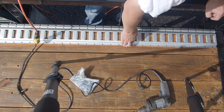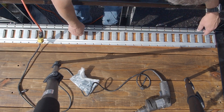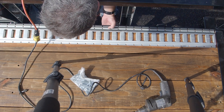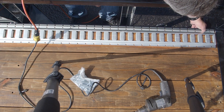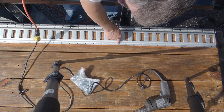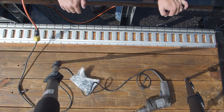That all lines up really nicely. I've got a structural member here and another here, so I'll be able to tie into those. I'm going to leave a little bit of room at the end so my bolt is centered. There's a two-inch by three-sixteenths angle iron — actually it's a three-by-two — going in underneath. I'll drill here and here, being careful to avoid the HSS tube that holds the LED lighting. Two at the end as well, so we're into structural the whole way across. Let's get going.